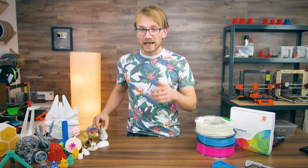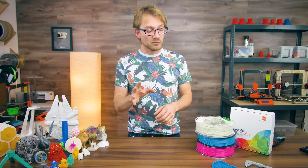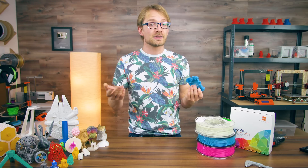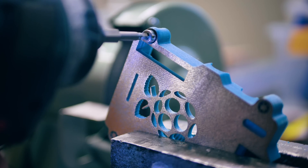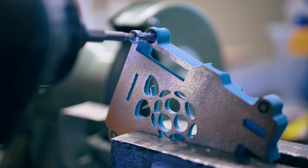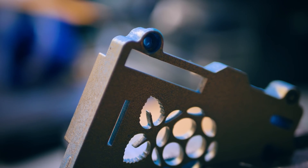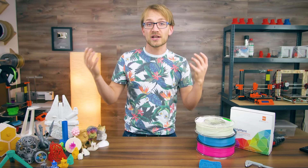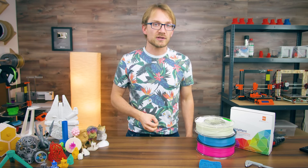Especially with PLA, I would recommend oversizing mechanical parts by a bit, because some grades of PLA like to develop stress cracks over time, just like laser-cut acrylic does, and it will also deform under continuous pressure, like under a tight screw head, and basically very slowly flow out of the way. It's also probably the material with the lowest usable temperatures, so PLA is definitely not dishwasher or even sunshine-safe, but that's also what keeps it from warping during your print.